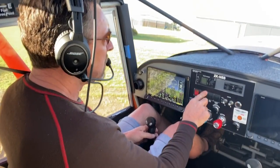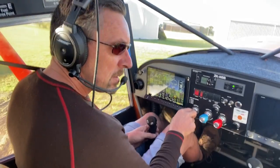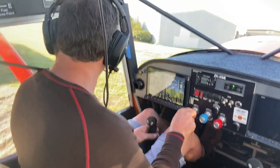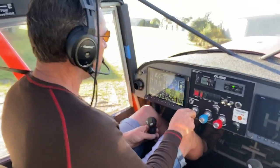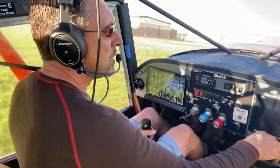The first area that became really apparent on my very first takeoff was a lack of right rudder control, which caught me by surprise. I thought it was due to engine torque, prop factor, precession — that kind of thing.